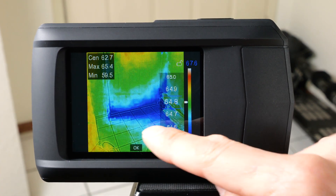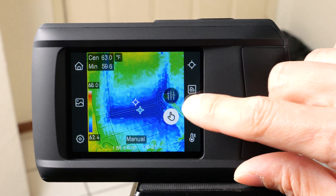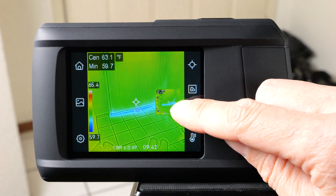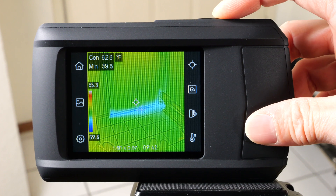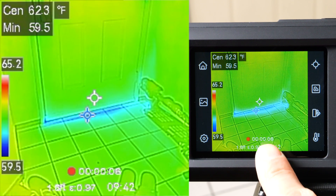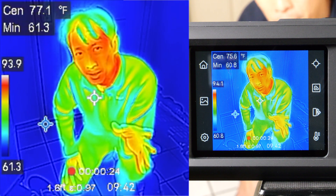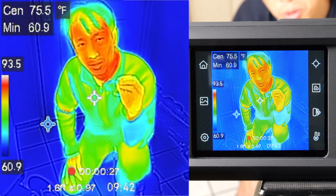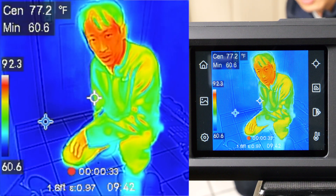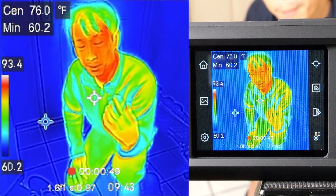There is a temperature range setting — if I want more of the blue to show up, I can slide the range to make that happen, and then just go back to the default by pressing the reset button. To record a picture, you click once and it shows up briefly. To record a video, you press and hold, and a red dot appears showing it's recording. The mic sounds reasonably good — all you need is to use it as a reference. When you're recording, you can narrate notes like the type of insulation at a given spot, so when you play back the video later you know what you were looking at.